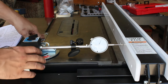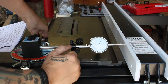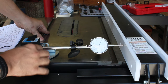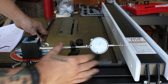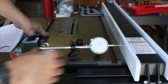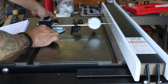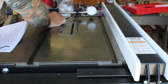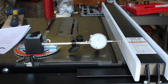So far so good. This has probably been the most tedious part of adjusting this — maybe spent the past 15–20 minutes. You want the fence to be angled out about a 64th of an inch, which comes to about 15 thousandths on the dial indicator. I just have an anchor jig and magnetic base dial indicator. There's a minute amount of end play here, about 5 thousandths. I'm doing my best to keep the miter gauge pressed up against the table slot. With a little bit of adjustment, I have it down to approximately 15 thousandths out at the end, give or take — it's about 16 there. Good enough for me. I'm not usually this much of a perfectionist, but I figure I spent the money on a nice fence, so I'm going to try and get it set up as well as I can.